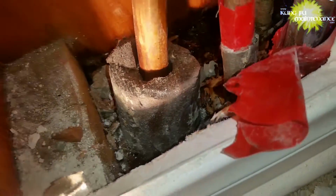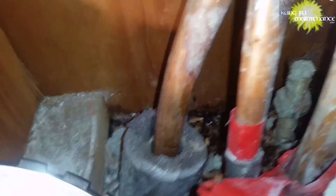And that's kind of the problem sometimes with slab leaks. They can trick you. You can think they're close by, and they can actually be 10 feet, 12 feet, whatever. Fortunately, this one was in between the ball valve, that's the shutoff for this unit, what normally is. Again, this was an end unit, and was fairly easy in the scope of how bad it could have been, because if the leak was somewhere else, it can be even more difficult to figure out what it's supplying. But again, you can cut it, cap it, and then figure out what you don't have water to, and then you just have to determine what is the correct direction of flow, and then rerun lines where you need them to go.